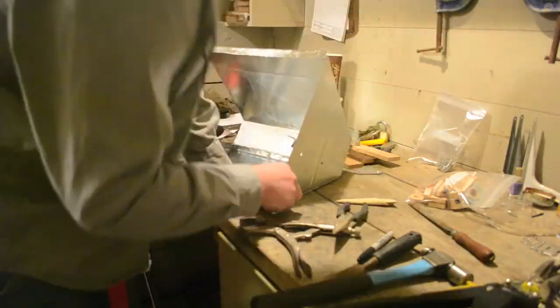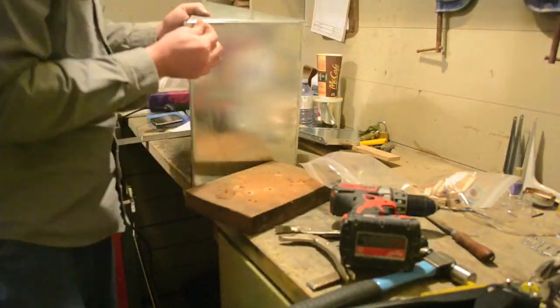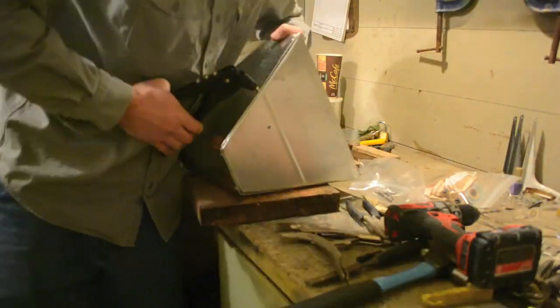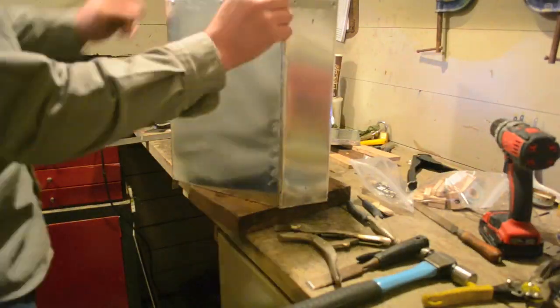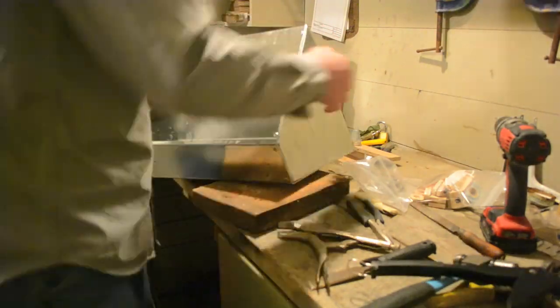To line up the sides of the oven, bend the 1-inch tab of the back panel 90 degrees so that it tucks inside of the side panel. Push the right side tight against this panel and drill through the back panel. Rivet this hole and continue with the other holes on the side.